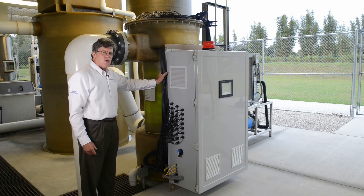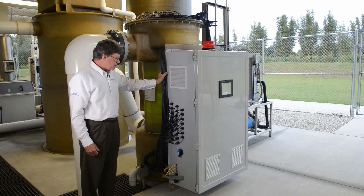The monitor — the control panel will monitor the lamp life, the total number of hours that the lamps have been operated, so that the lamps can be changed frequently to maintain the proper wavelength to get the kill rate on the harmful pathogens that you're working on.